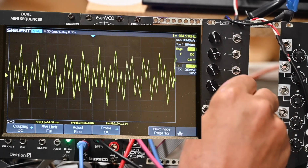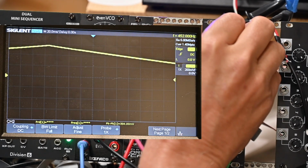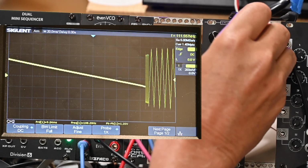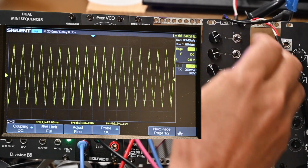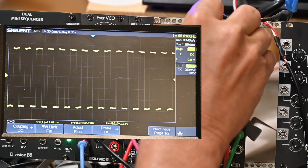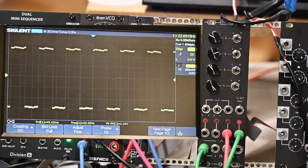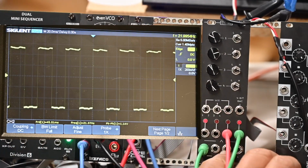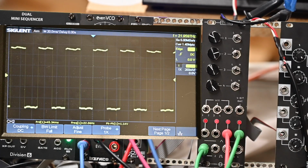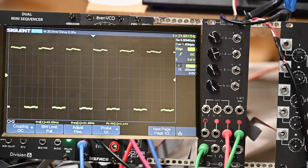But fundamentally, if we go back to simply being an LFO, both as a triangle wave and as a square wave, even though as you can see, at least at this level, the peak has a little ripple in it, not much, but a little bit, just interesting. So that's it. It's a 4-output LFO with triangle waves and square waves. I wish it had 4 sine waves. I'm kind of sad that the last 2 LFOs I've done don't have sine waves.